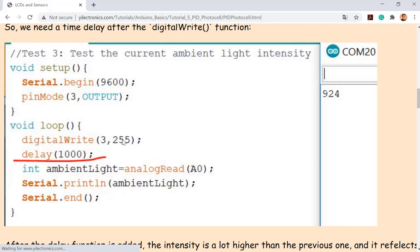So it's going to saturate the LDR. That making sense? Definitely, if you put an LED here and the LDR here, I'm pretty sure you couldn't sense anything from the LED because the ambient light will dominate the brightness or the signal being received by the LDR. You move it closer, closer, closer, and until it's super close to each other, I'm pretty sure that LED's light will dominate the signal being received by the LDR, but not the ambient light.